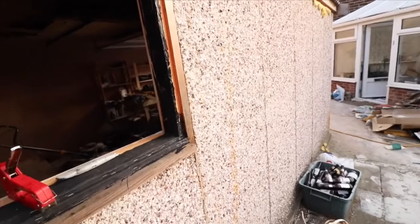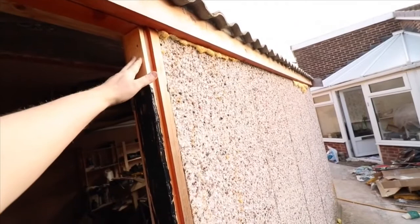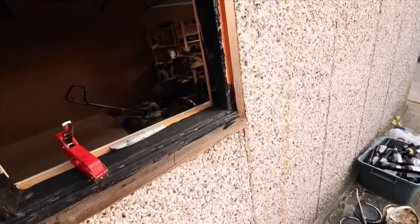It's not easy, it takes a lot of work, a lot of sanding. I've had to sand that down from 18 mil to about 12 mil so it'll fit. And then once we've got the window in there, we will be using some expanding foam to fill the gap. So I just wanted to talk you through it, tell you what I'm doing with this, and I'll see you in the next video.